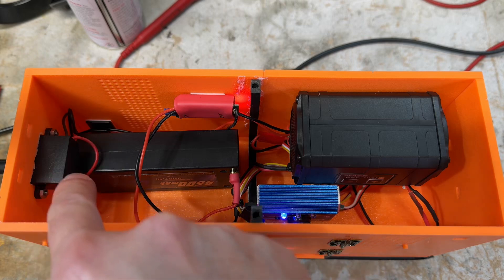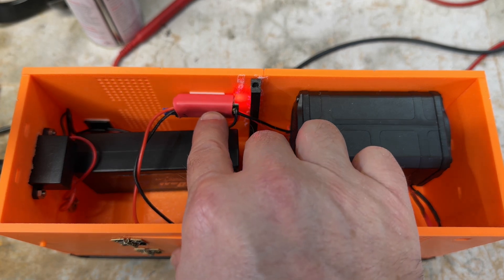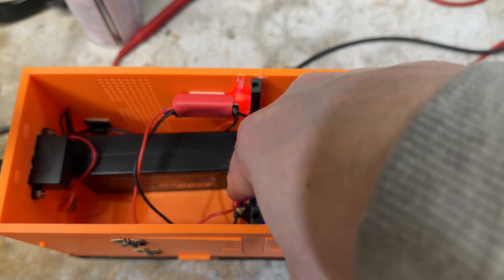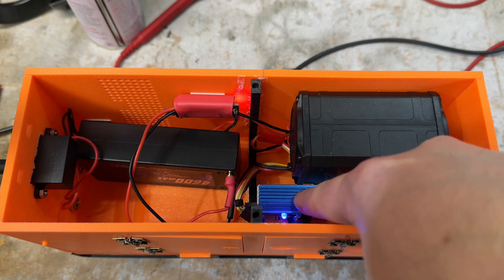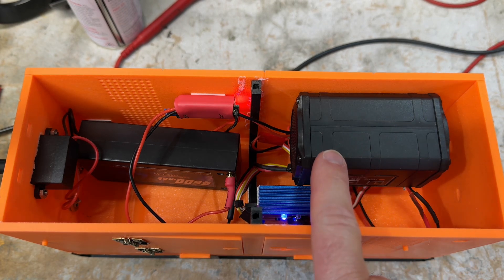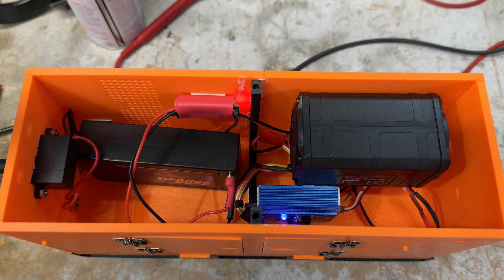Starting this end inside, we've got the voltage meter - it's an LED one, available from Component Shop, fantastic guys for electronics. I've got a six volt three amp BEC. This is a 2S, so 7.4 volt LiPo, and I've put a couple of four mil banana connectors in there to couple that up. I've got the servo tester here - only a few pounds from Component Shop. As well as testing servos, they're really handy for things like this. I've got a Sense Innovations ESS dual sound unit, which I've programmed to sound like a diesel engine.